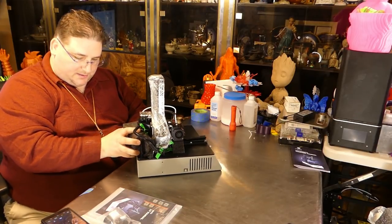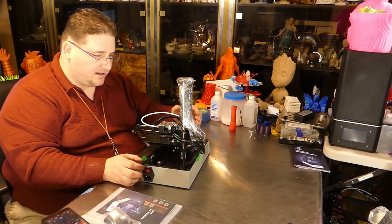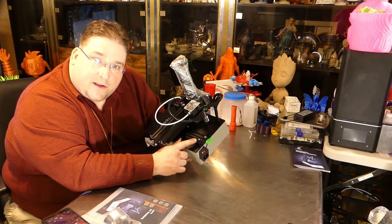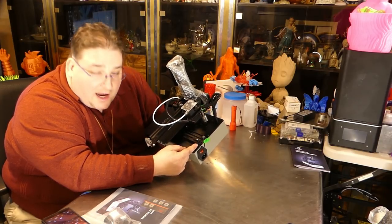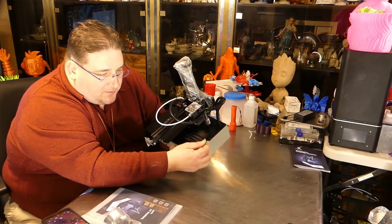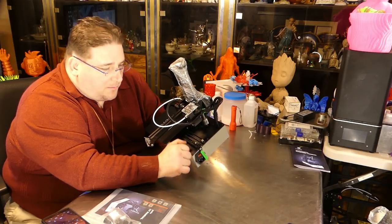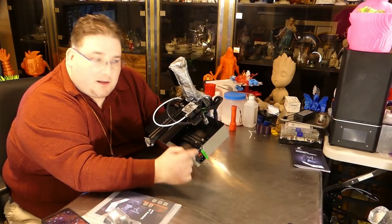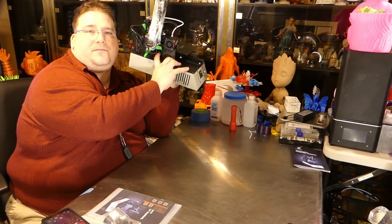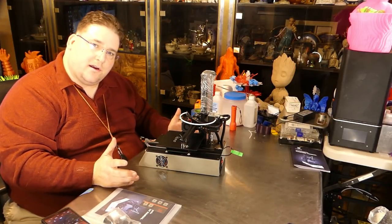This printer has very interesting new features. Take a look at the end stop — it's infinitely adjustable. There's a bolt right through the end stop, with a hammer nut inside, and you loosen it and the thing moves back and forth inside the rail. No more end stop issues — that problem is now gone. You'll never have to print an end stop adjustment ever again. It's optical in some way — not light-optical, but when the machine hits it a little light comes on inside and it stops. Same thing on the Z axis. I'm hoping we can purchase these and add them to our other printers.